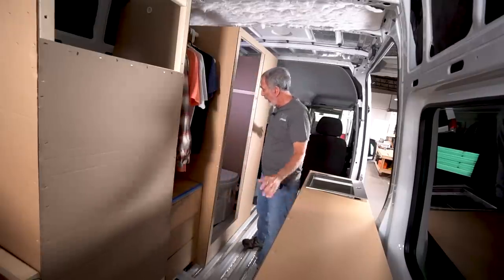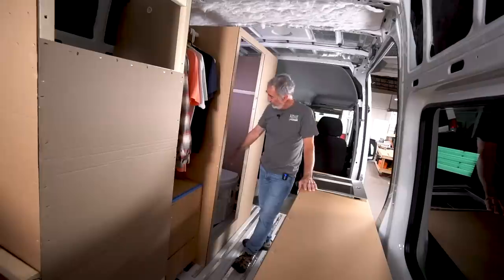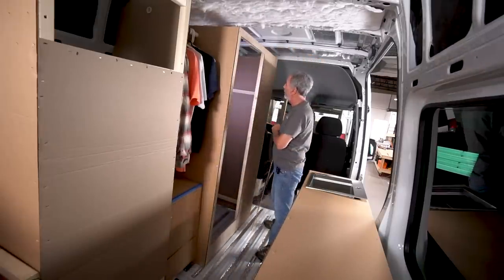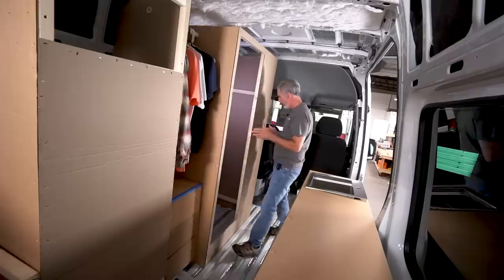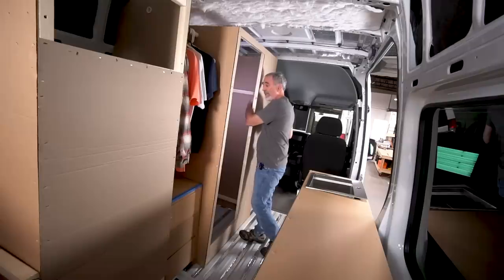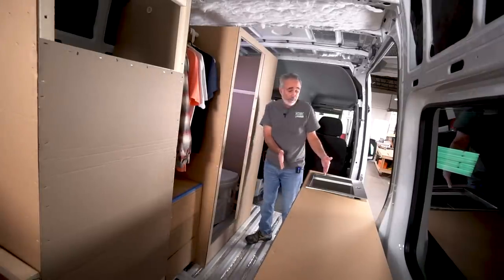This client wanted a very large bathroom — as large as we could make it. I put in a larger bath; I think this is 38 by 42 net on the inside. It's a wet bath — the bathroom and shower are all contained here. I'd rather have a sliding door rather than a hinged door, though it can go either way. I like a 22-inch opening on the bathroom — a single pass-in rather than double doors, which gives you an inner wall for a medicine cabinet.